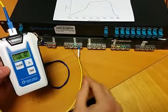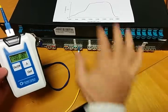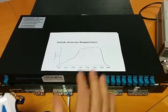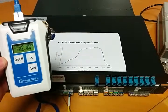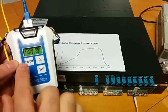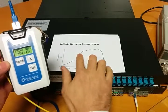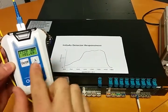The detector is more sensitive to specific light. It has a specific curve for that, as you can see here. The device doesn't know which type of light it is receiving. If I'm testing, for example, the 1310 here and I want to have the correct value, I have to set it to a specific value, as you can see here.